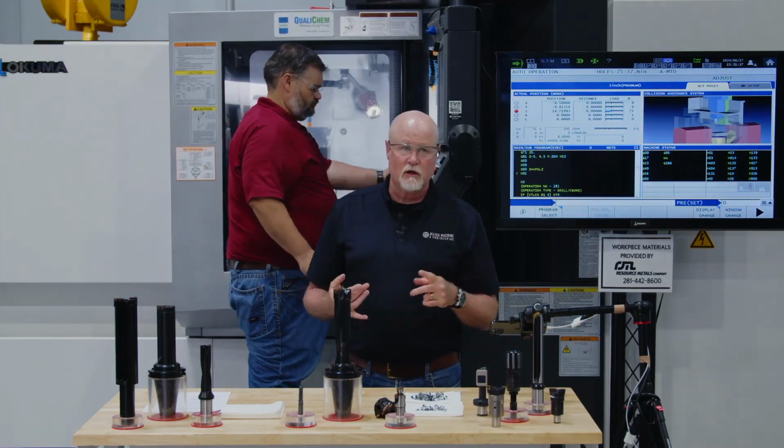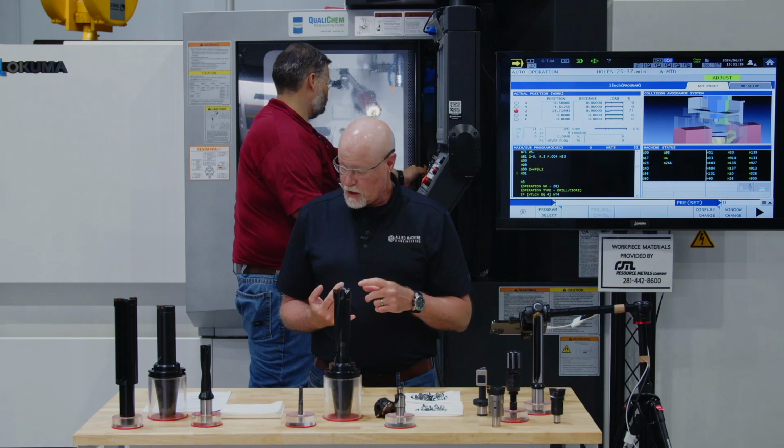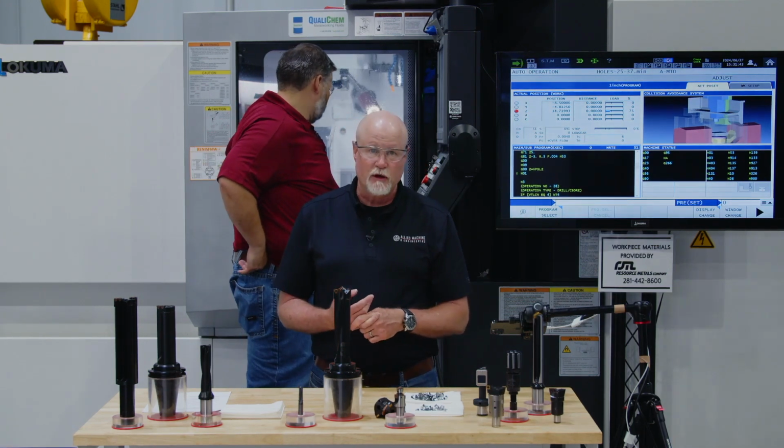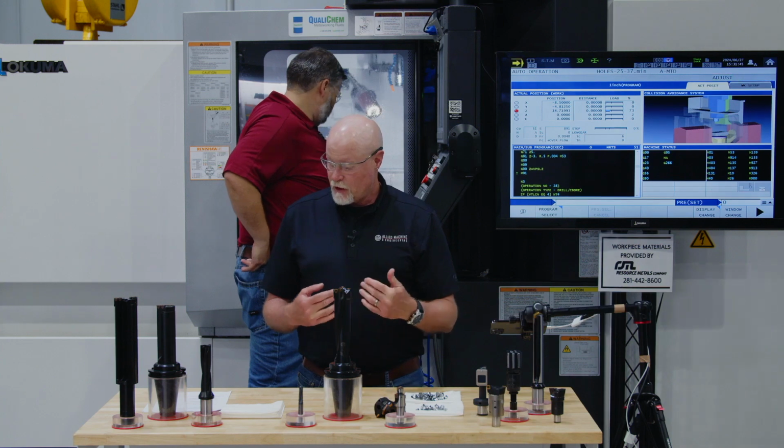So now we're going to do a second hole profile. And with this one, we're going to start off with a revolution drill. The revolution drill is set to 2-inch diameter, and we're going to go to a depth of 2.5 inches. And then we're going to follow that with a Combi-Line.